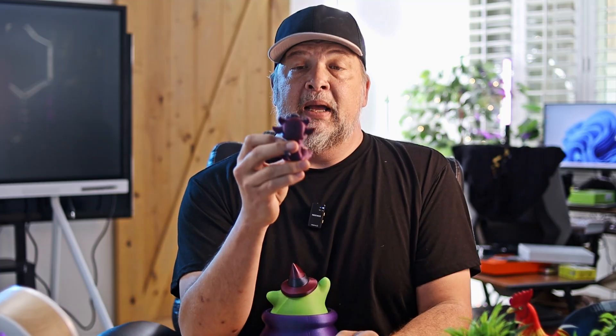The next thing I did was this little bowl because I wanted to try out the multicolor printing. With multicolor printing, the machine will automatically switch the colors for you. If you have four colors in your print, it will automatically switch the filament. But when it does that, it has to purge a little bit — there's still a little bit left in the nozzle that it has to get rid of and then bring the new color in so there's no mixing. You get a clean print for the multicolor, but that can become a little bit wasteful depending on how you set up your 3D print.